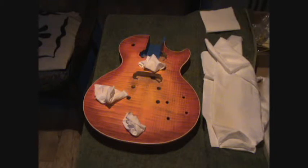My experience on the back showed that some of the dye comes off when you apply the True Oil. I should imagine that slows down in subsequent coats, but in anticipation of that, I've got 3 pieces of rag so that I can use them for separate areas. So should there be any colour bleed, I can go one for the red around the outside and a piece in the centre, and a clean piece should either of those get too mucky to use. Okay, so let's give it a spin.